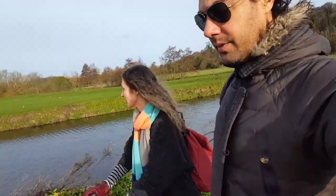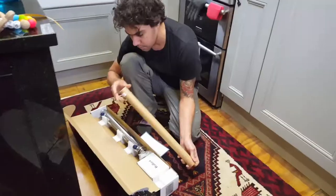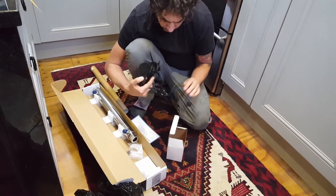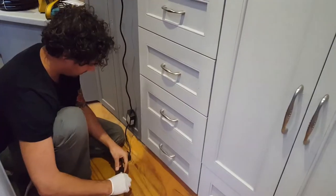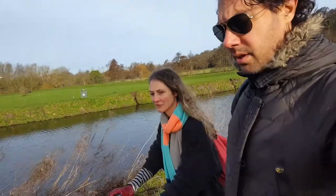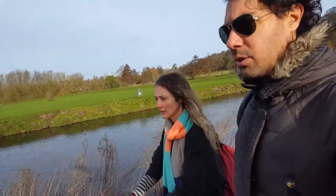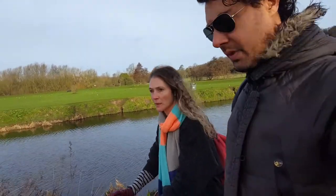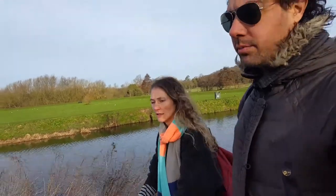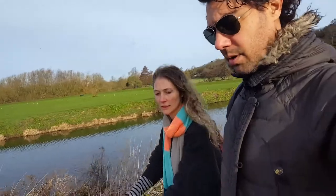There was a fault with the first one, they sent a replacement and it wasn't working. Now they've sent out a whole new kit — which is really kind of them — that they tested before they sent it, and it's still not working for us. So we want to make sure the ballast can light the bulb, and then from there maybe get a bigger ballast. Get a 30 watt ballast for our 25 watt bulb and hopefully that might work.